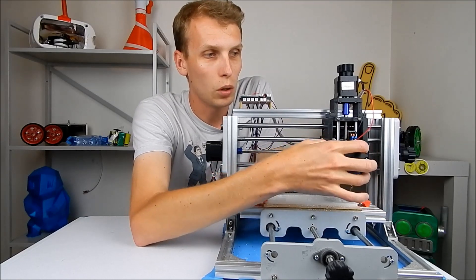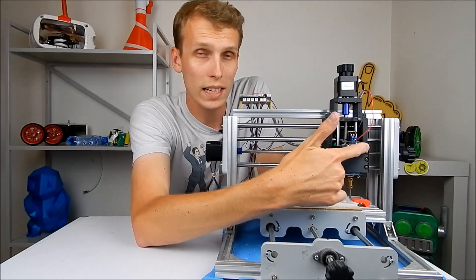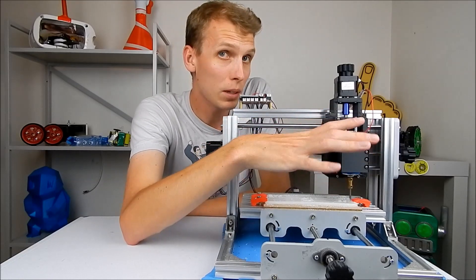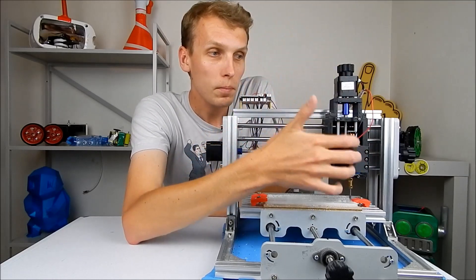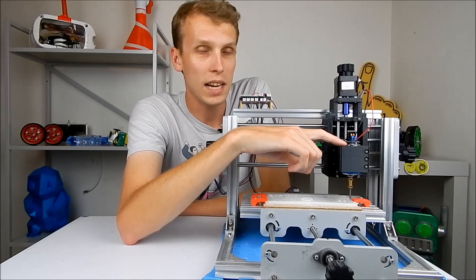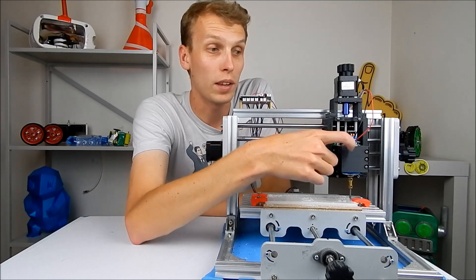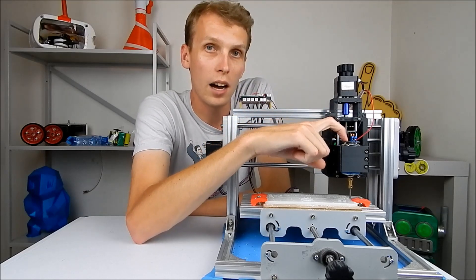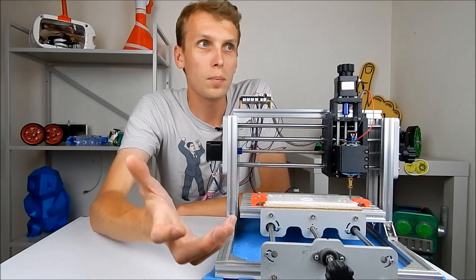Also, because it's 3D-printed, there was a little bit of play in it, and they're running screws directly into 3D-printed plastic. I put this thing together the first time and it held the motor okay, but not great. Then I had to take the whole thing apart for maintenance, and the screws didn't grab as well the second time, which meant the motor could move inside the motor mount. There's actually blue tape around the outside of the motor right now holding it in place.